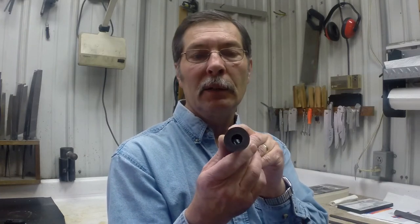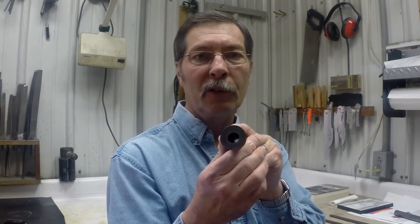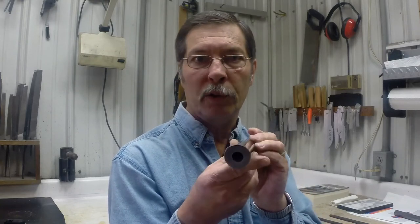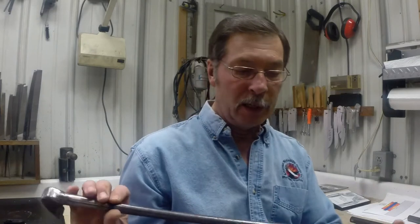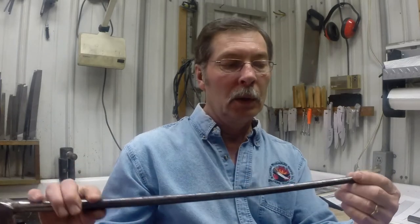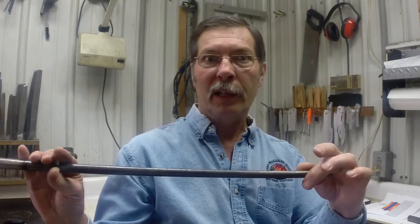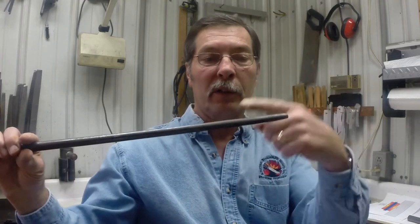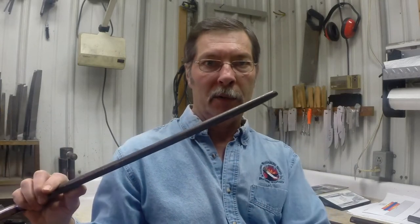Now, as I said, in trying to push this barrel tube down as small as possible, I might consider taking that chemise out first. As it is, and being this is really the first attempt to forge down an old tube, I'm going to go ahead and leave the chemise in there and we're going to see what becomes of it. Now, I myself will be using the forging mandrels during the early part of my process, again, to control forging it down. It also helps in case of errantly over-intensive hammering that you don't crush the bore of the barrel, but I'll gradually be pulling this out and forging it down around the end of the mandrel until I forge it down as small as I can with a mandrel.